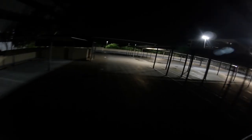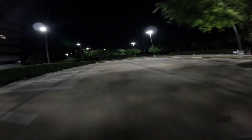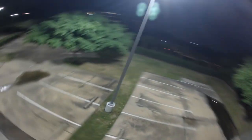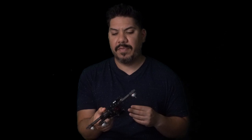If you're looking for a very lightweight, compact freestyle frame, this is it. I'm going to put the RunCam 5 on it because I want to keep the overall weight low. I haven't done an analog freestyle build in so long, and it was nice to get everything built up very easily, very quickly, and very cheaply. You're getting high-grade, top-end engineering for a mid-range price — a lot of these motors go for under $20 a piece, and the frame is only $65, and it comes with a lot of hardware, including the special XT60 mounting.